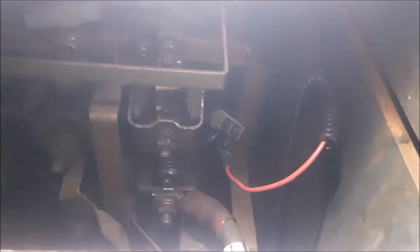That's it. See, bypassing that wire from one end from the coil to that operated the contactor. I don't know if you heard it, it operated the motor. So the fix for this is we're gonna have to find that break in the wire, right? I'm gonna tidy this up. Now I have to talk to the customer if they want to replace a harness, which I don't think he would want to do, or we're just gonna be doing the same thing, bypass that wire leading to the computer, and that will be it for this.